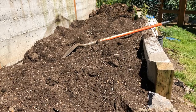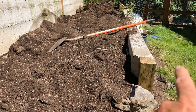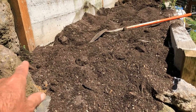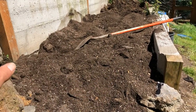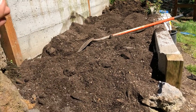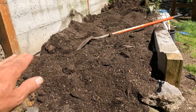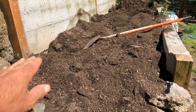One thing I don't know if I made clear when I was building the walls: the top of the bottom wall needs to be higher than the base of the wall coming up on the next level, so when you fill it in with dirt there's actually dirt pushing against it. Not that that amount of dirt on the bottom is going to hold a lot in, but you don't want the ground sloughing away and wearing away over time and not being solid ground.